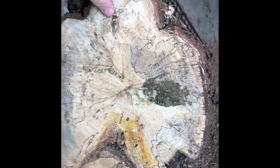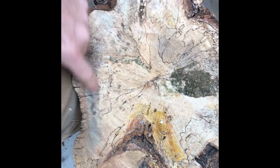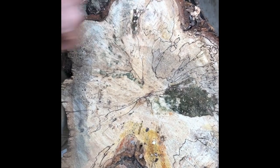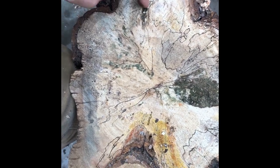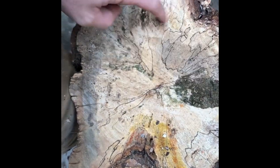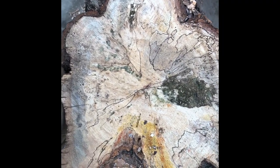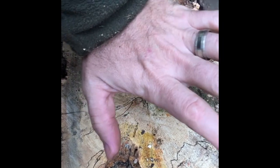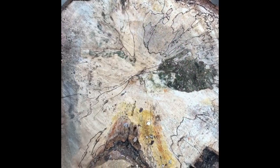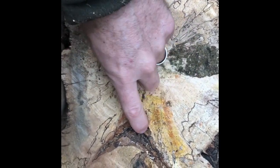I made an exploratory cut — this is pretty spalted thoroughly all the way around. This is a piece of pecan I was showing earlier, along with some maple. This is good, this is what I like to see — it's still really dense, there's not a whole lot of punky section to it. I want to get it out of the weather so the spalting can basically be done. I like where it's at right now. I get a lot of yellow and orange in here too, so that's kind of nice.